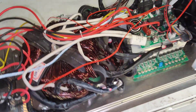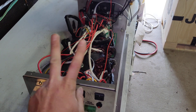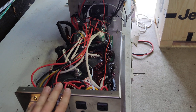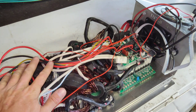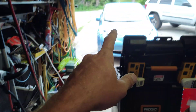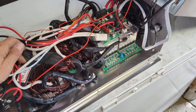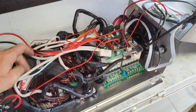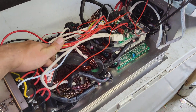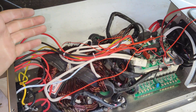Anyways, this is just a peek to see what I'll be testing next. I will be hooking this to my house, which normally requires at least two Magdesign inverters — which are 4,400 watts each and can surge around 9,000 to 12,000 watts. I used to run the house on one and it overheated a few times, so I bumped it to two. Then when I ran the dryer and charged my electric car and ran everything else, I ended up overheating them again — I was pulling about 12,000 watts out of two that are rated for 8,800 watts. So then I got a third one and I've never had a problem with three — that's over 13,000 watts of capability. But this single inverter is going to attempt to run what three run. It's either going to burn up, or it's going to do well, or it'll do what it should do when it's overloaded — shut down and go into fault mode. We'll see.